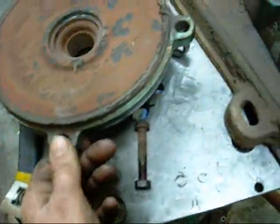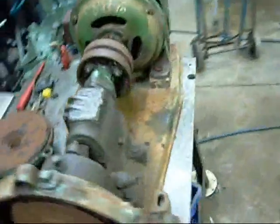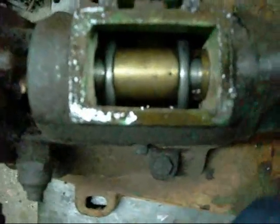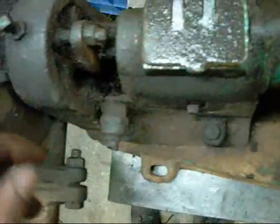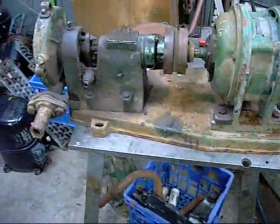The impeller has been sitting long enough that there are paper wasps inside the galleries. The housing is also pitted and the gasket is just disintegrated. I don't know how the pump is going to go working, but I'll get the motor restored from the base. The pump has its own little oil rings and solid bronze bearing — all of that's got to be cleaned up. So it's time to take this thing apart and start de-rusting and de-painting.